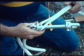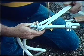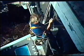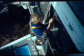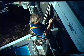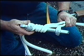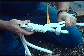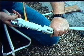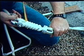Remember, anytime the Sky Genie Seatboard system is used, 2 lines are required. They are wrapped together as one. But for determining friction, only one line is counted. That's because pulling down or lifting up on either line will stop you. This looks like 4 wraps or turns, but it's really both safety lines wrapped twice, so it's only counted as 2 turns. Another loop of each line is needed to achieve 3 full turns to comply with the 150-pound minimum.